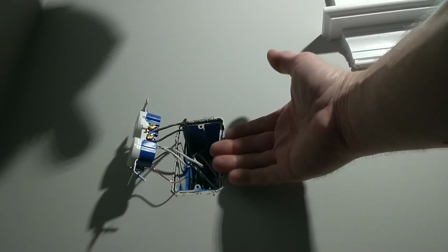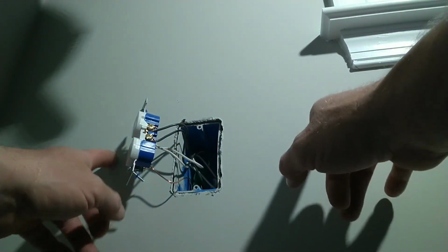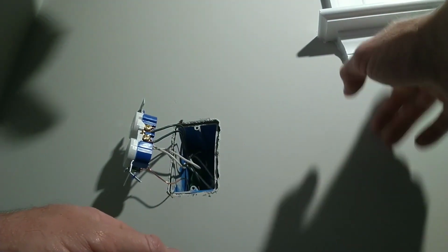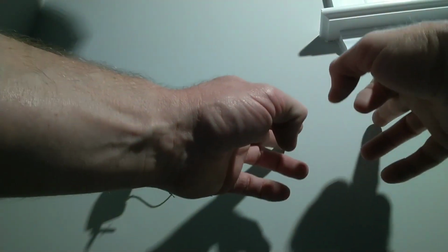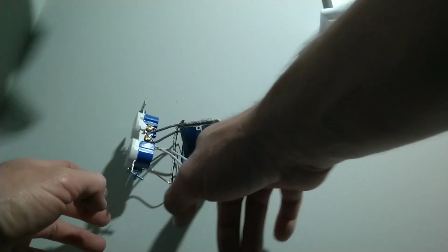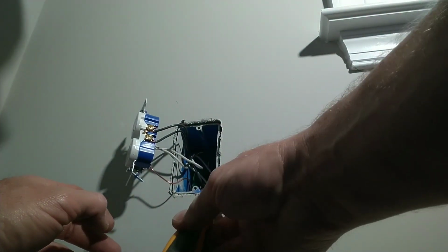And there are different reasons for these boxes not being flush. One could be improper depth when this was actually nailed in place. Another could be variances in the studs in the wall not being lined up with each other. And I lined it off of this stud. Of course, we're by a window. You can see the window frame. There's a group of jacks and studs here, which could be causing this box to be set back from the stud that I actually nailed it to, which is on this side, due to these little tabs.